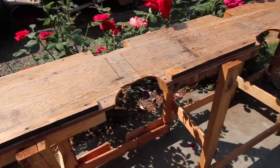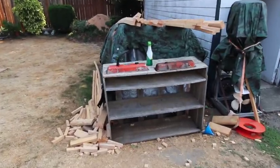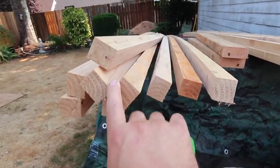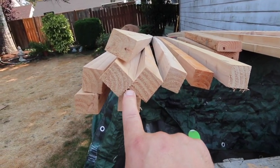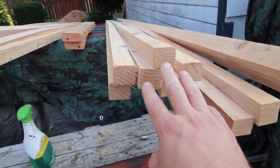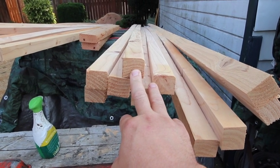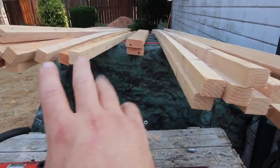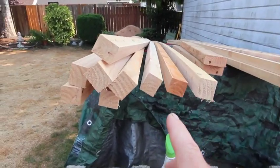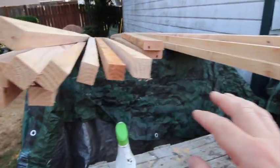Let me go set up the lumber for the roof trusses. I have these set up here — the bottom chords I cut to 161 inches long, and the ones that go over the top are 162 and an eighth to compensate for that bend. I took two-by-sixes and ripped them through the table saw to the same length as the originals.